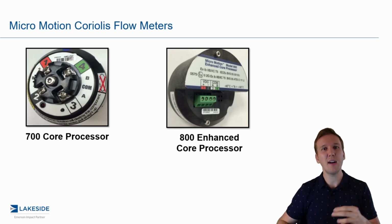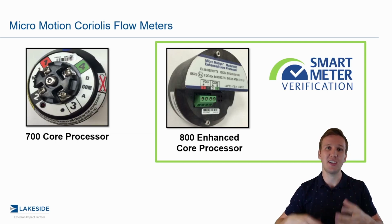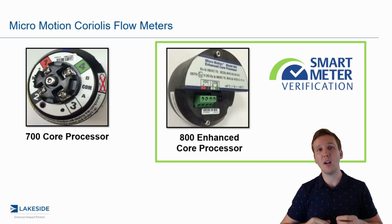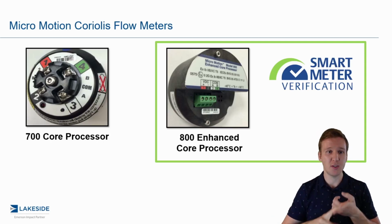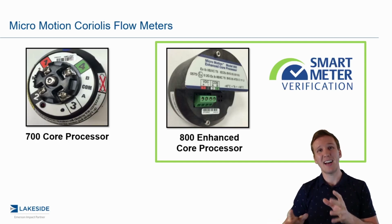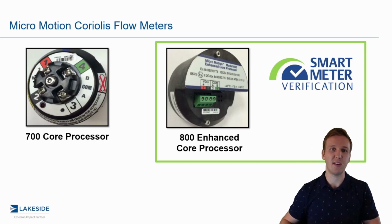And why does it matter? Like I said, this enables us to utilize this SMV feature. So if you have the 800, fantastic. You can enable Smart Meter Verification, which is a very, very handy tool. As well, depending on if you have a core processor or depending on where the core processor is located, it allows us to have different flexibility options in the installation, which we'll talk through in the next video.